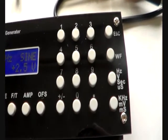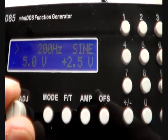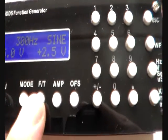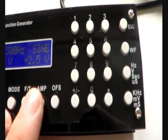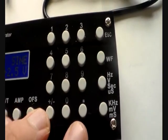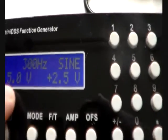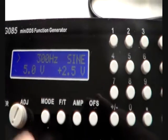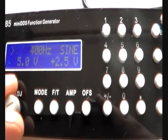So now I have built this DDS signal generator and it's working. Here you can align the frequency, or you can also type it in, and it has various features — like you can change the waveform, which is WF. You can also change the output voltage; here it's 5 volts but you can change that. It has lots of features. It goes from, I think, 1 Hz to 200 kHz.